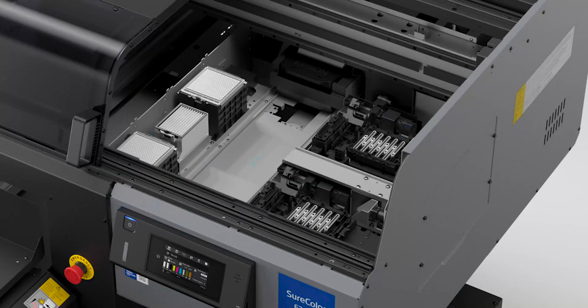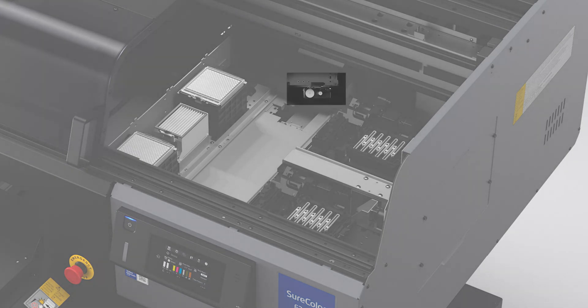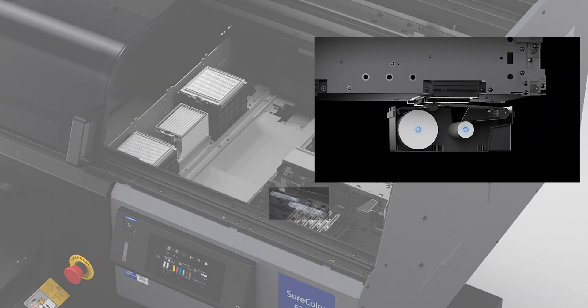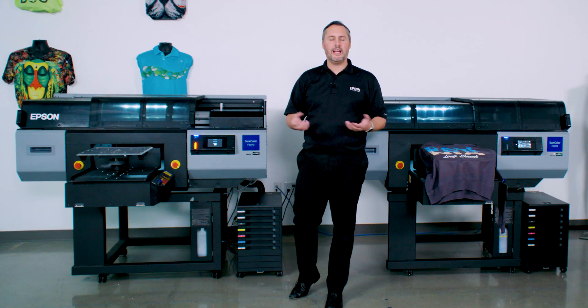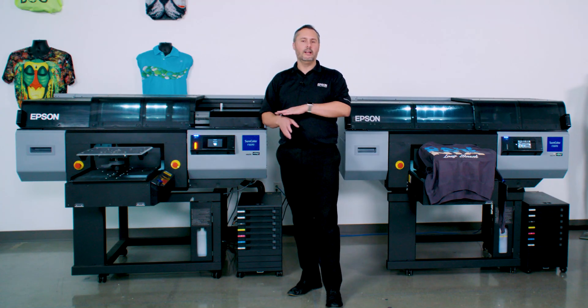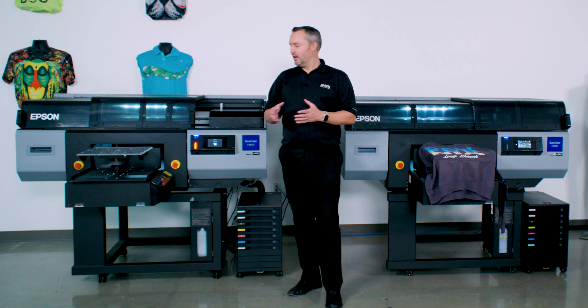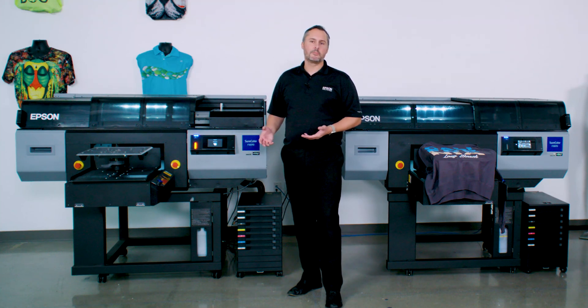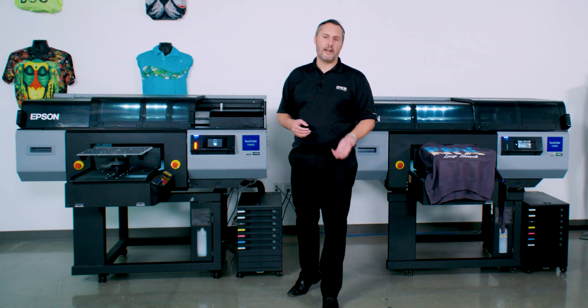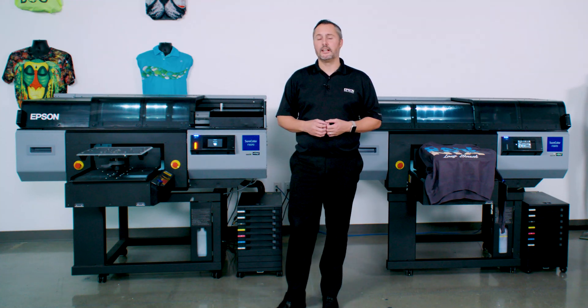There's also a maintenance cap where we use our maintenance liquid in the system, pumping it through our cleaning station to remove any buildup of ink or debris. We overflow those caps to make sure all debris gets away from our maintenance station, and we collect that and send it down into a waste bottle. This helps ensure the printer can work in those harsh factory environments.